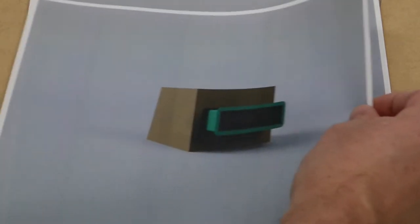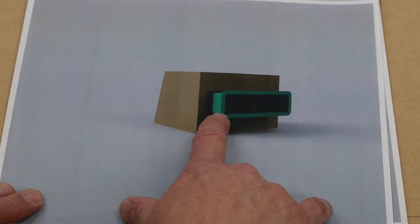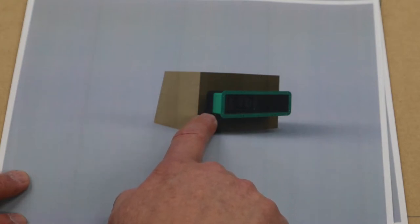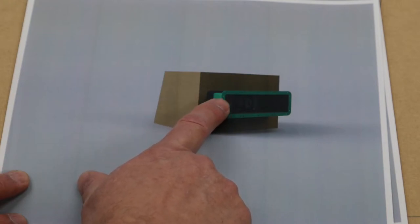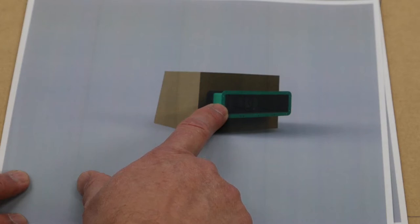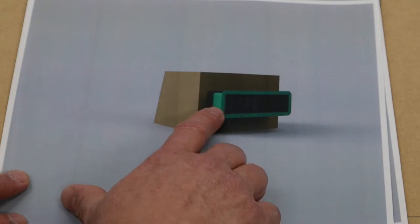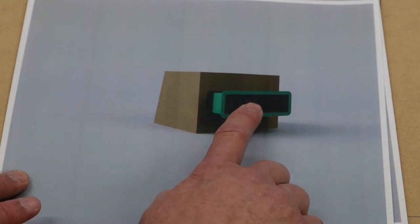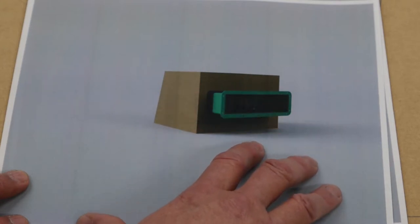As we spin this around, we'll look at the back of the paint booth, and I'm going for a 3D printed output flange or port, however you want to say it. These are actually two of them back to back. One piece will bolt up against the back of the paint booth. The other piece will bolt up to a large panel that will fit in the window. And then these two pieces can telescope into each other for a distance of about 3 inches. But it's a full wide open port to the outside of the building, and that should allow for the freest flow of air from all four of these fans.